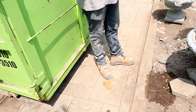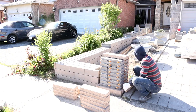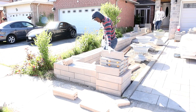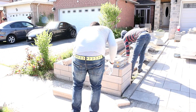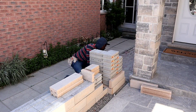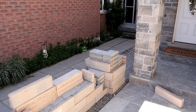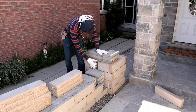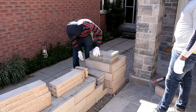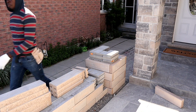A neighbor stops by — "this is beautiful!" — and here I'm installing the siding right now. Those yellow clips I demonstrate more in part one of the video. It's super easy: all you have to do is clip four of them on each side, push the bottom in, and then push the top up. The most difficult part of this Unilock is just catching the first layer — once you catch the first layer you're good. Just take your time and get it as level and square as possible so you don't run into problems later on.